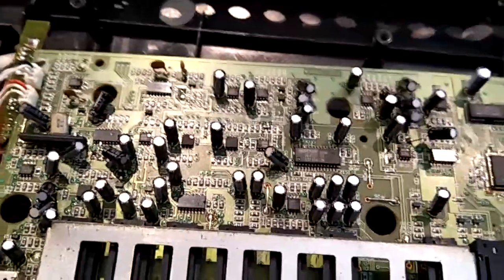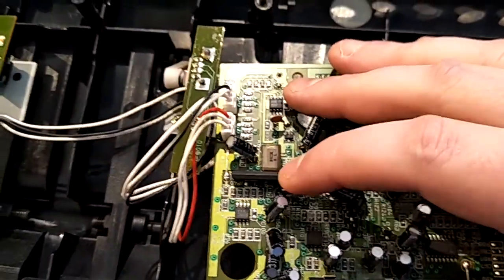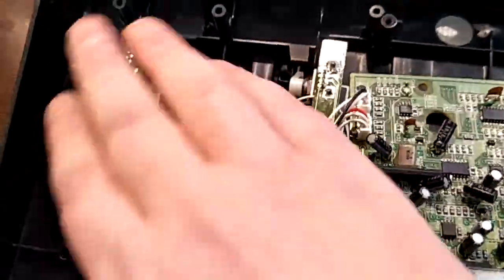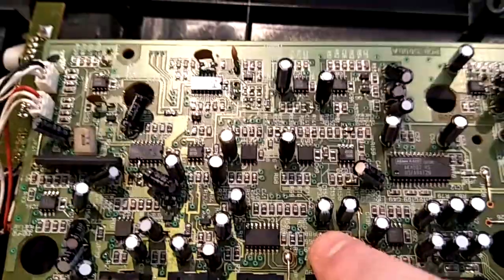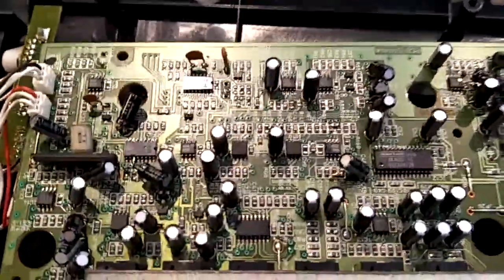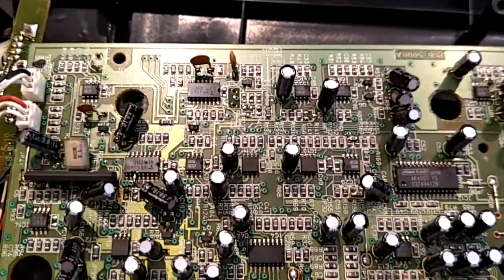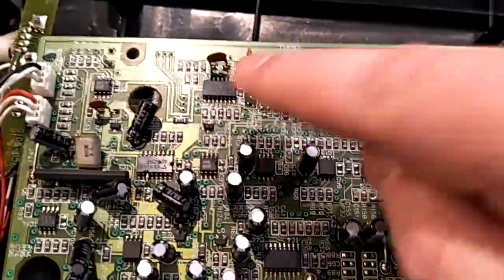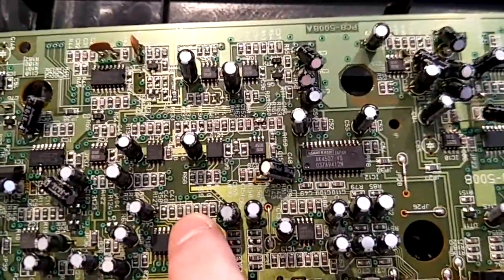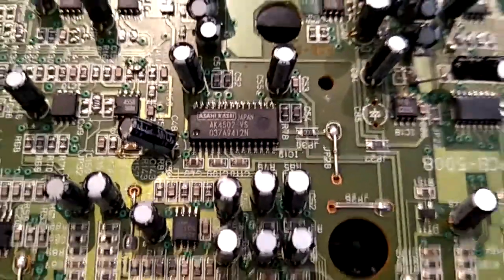It's a very powerful unit. Over here is the standard Mitsubishi dual VCA chip, which is directly wired to the volume pedal. The expression pedal goes to another part of the circuit. Around here there are a lot of 4053 analog switches — these handle switching resistors and capacitors in and out of the circuit for the different distortion modes. You've also got some op-amps for the distortion.